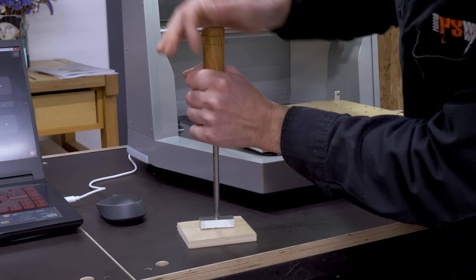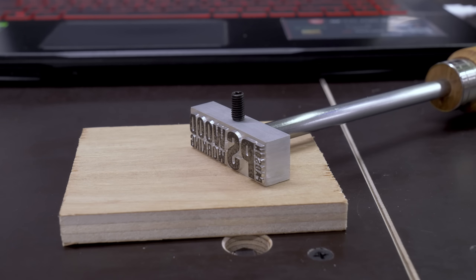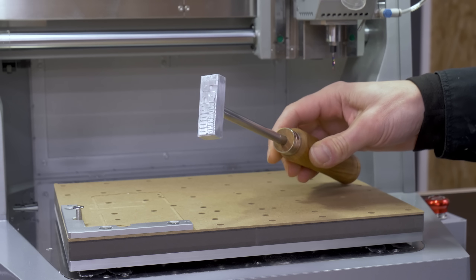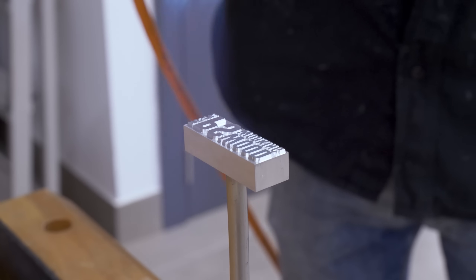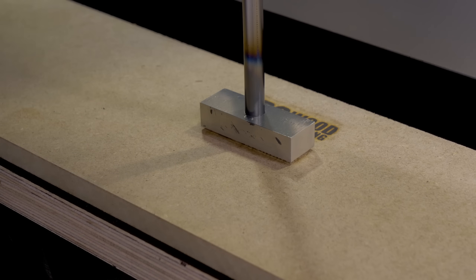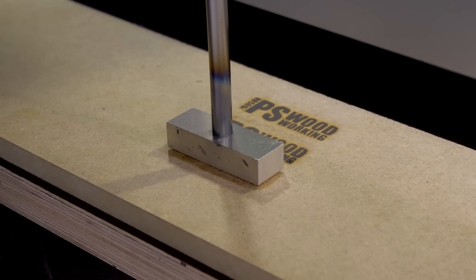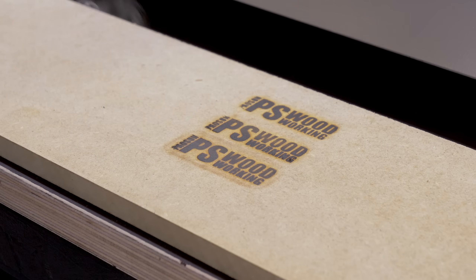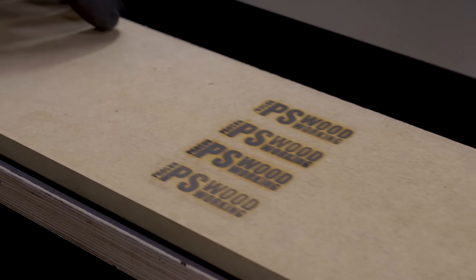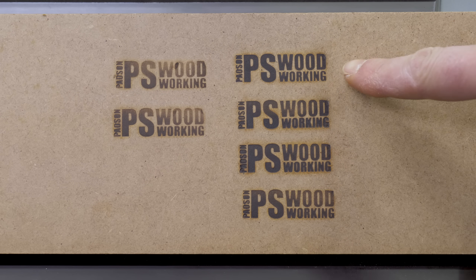That aside, I'm looking forward to trying out this branding iron. I'm going to use this olive handle I made a few weeks ago. Ideally I should use a headless screw, but the handle fits in so tightly I'm going to try it out as is. It's not easy to find the temperature-to-pressure ratio when using this kind of branding iron, but after a few tests I think I got some decent results. Due to the heat, the aluminum has expanded and the handle is a little loose, so I can't put the right amount of pressure. Considering it's my first branding iron, I'm quite proud of the end result.